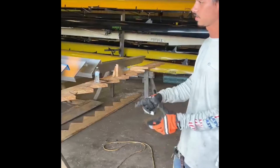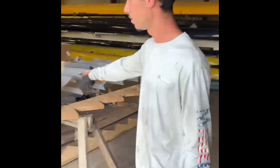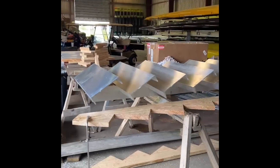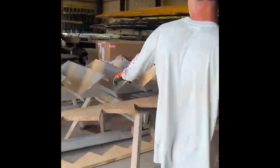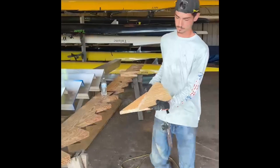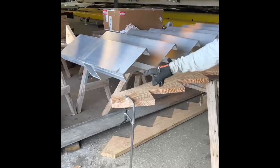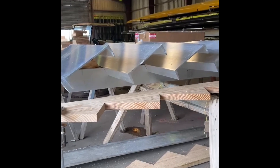There's a six-inch cut through the middle of each channel and that's going straight into the middle of the six-by-six. The beam is cut at an angle and that's going to fit straight up and down. Right now on the step I'm just making a wood template, kind of like this, to fit it up. Once that's all fitted up exactly how I want it, we're going to cut out that plate — that's going to be the fit-in part — and it's going to be all welded together and done.